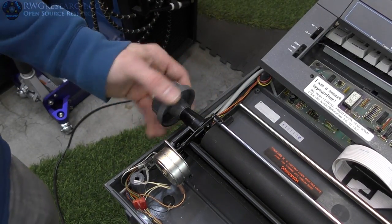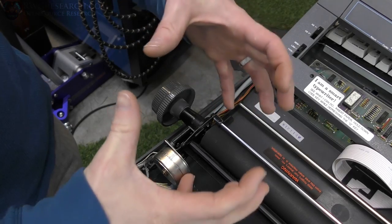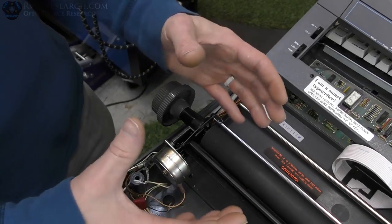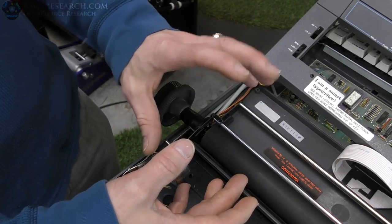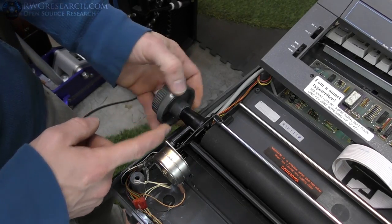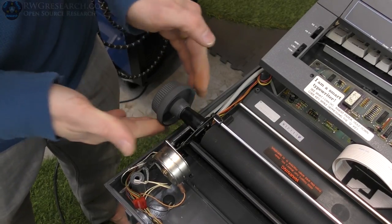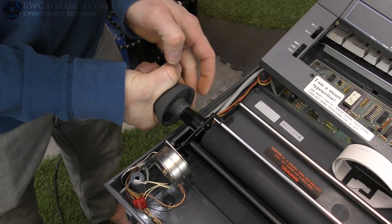Typically with this type of apparatus you'd have just one lobe rolling around the outside of the other, giving you a gear reduction of one-to-however-many teeth are in there. In this case you'd count all those teeth and divide by two. That is actually super ingenious. Another application I saw this used on was a mechanical electrical valve gearbox that didn't have much room but needed tremendous force to turn a large valve — only a quarter turn, but with a lot of torque, because it's designed for a pipe with viscous, heavy fluid moving fast.